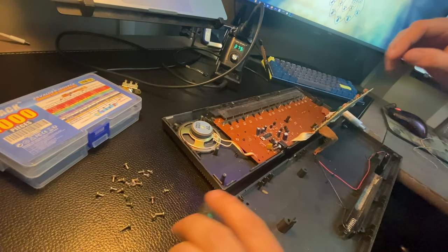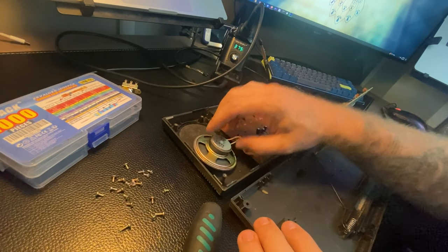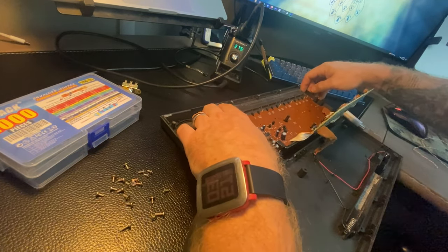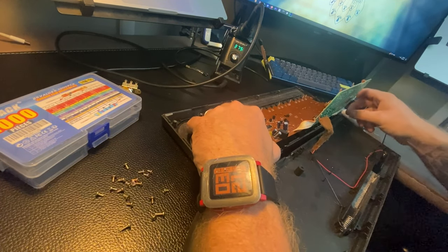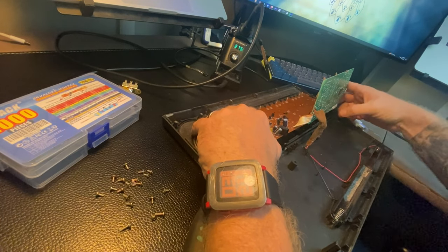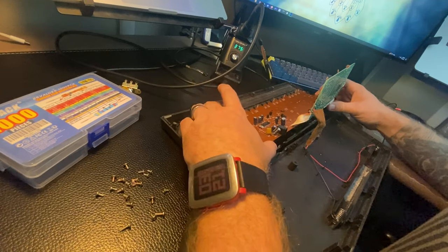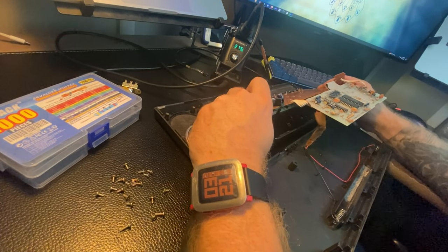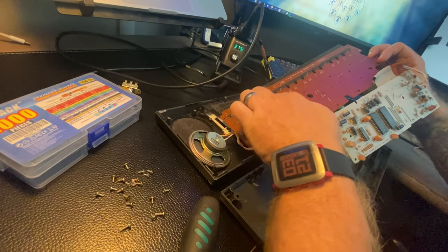All right, let's lift this board. Now, this should be loose already. It just kind of sits in there, so watch you don't damage it. We're gonna pull this board up here very carefully. Now, watch out, your keybed's probably loose, so we're gonna start from the back here to protect these ribbons. Take your time. So the black keys are gonna hang on these hooks right here.